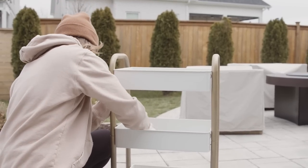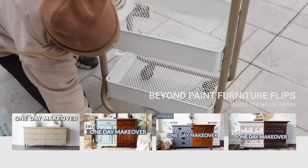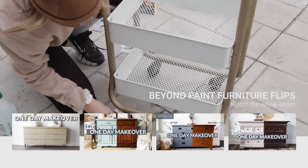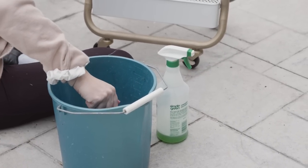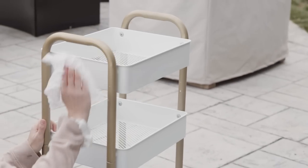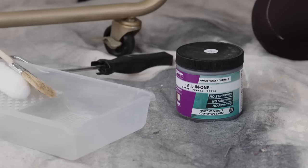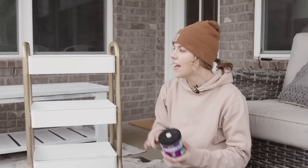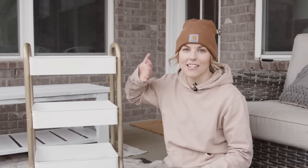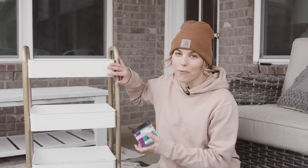When you're painting furniture that is already sealed, this cleaning is all you need to do. I've done lots of Beyond Paint makeovers so make sure you check those out as well. Before I start painting, it's really important that I rinse all of this cleaner off with some clean warm water. I have used Beyond Paint on lots of furniture before and love it because it's super easy for an average DIYer. You can also use it on outdoor furniture — so today we're doing the table and this little cart. I didn't have to scuff-sand this; it's going to stick right away because it has a bonder, primer, and sealer all in one.